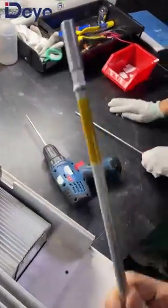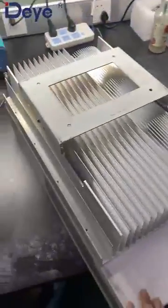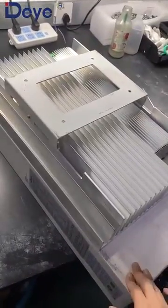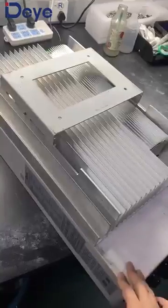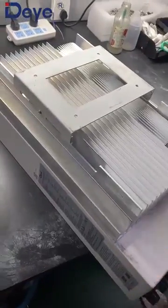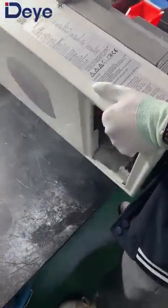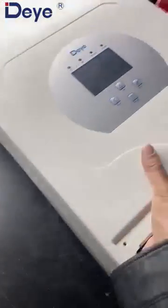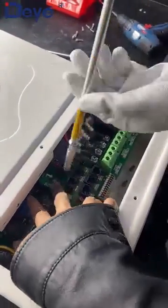You will also need to use this one. Before you open the inverter cover, we need to turn off the inverter completely and wait at least five minutes. Then we can open the cover. Turn it over — be careful. Now we need to remove this. Just four screws here.